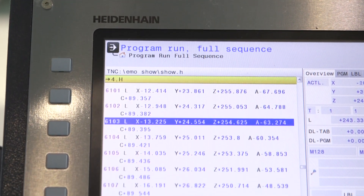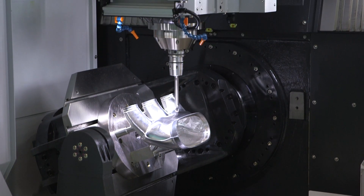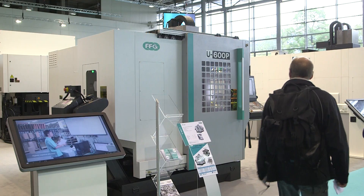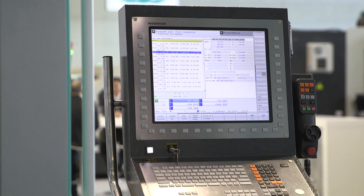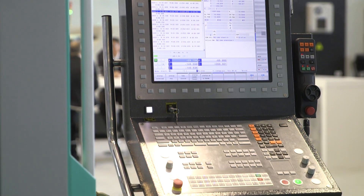What's new on this one? It has an LCM rotary table which is supported, a 24,000 rpm built-in spindle, full linear scales on all axes, and a Heidenhain iTNC 640 control — which is the latest control, of course. It is indeed.